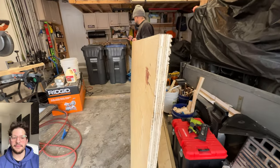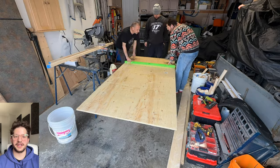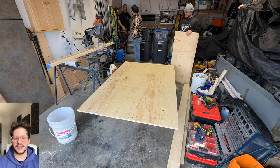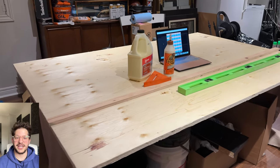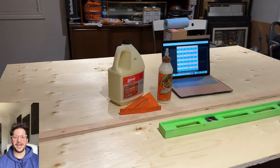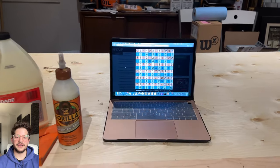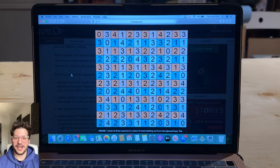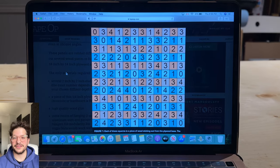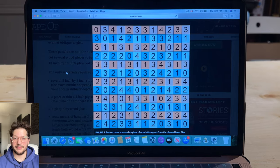Here is the backing board that we're going to be gluing to — this is 3 quarter inch ply. We picked up a 4 by 8 sheet and I'm just cutting it down to 6 feet in length, leaving a couple extra inches after 6 feet so that we can trim it down to final size. So now we have everything ready for the glue up. You're going to need wood glue — I'm using a high initial tack wood glue. There you can see the pattern that we're going to be following; I will put a link in the description for the pattern so you guys can follow along and build it yourself.